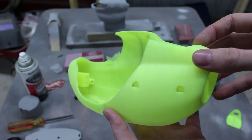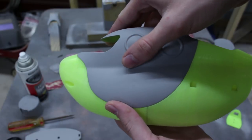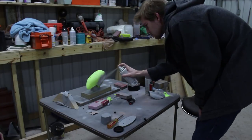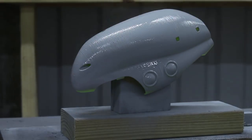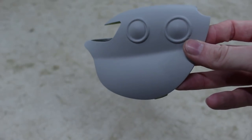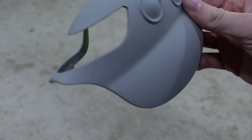After a few days and off camera, I permanently attached the two halves together with super glue. It's an extremely secure bond, and the other body panel fits snugly without falling out. So now the body work on the hull can begin, and of course I start with filler primer. After that dried, you can see that the layer lines still persist, but not so much around the joining seam where I'd already sanded it smooth beforehand. The removable piece has already been coated multiple times and sanded, so it's looking pretty smooth. Layer lines are still faint though, so I go ahead and give it a few more coats of filler primer, along with the main hull too.